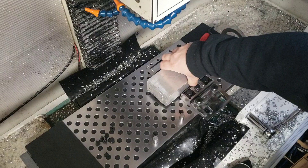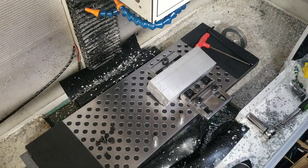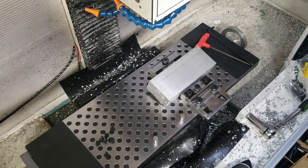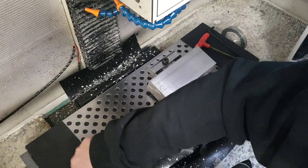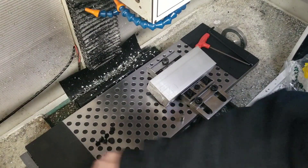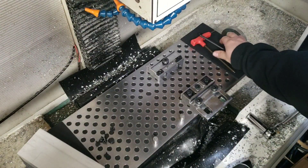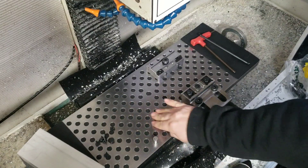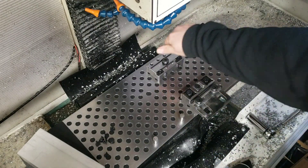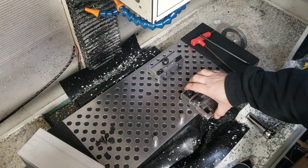I opted for the rubber fixture plate covers for the ends of the table because we only have 18 inches of travel in the X on these machines. You could do plugs all the way if you wanted to, but I figured this pad actually serves a double purpose — if I wanted somewhere to throw stuff down, set tools on, and not worry about hurting the plate, that makes a good spot for it.